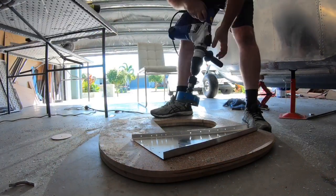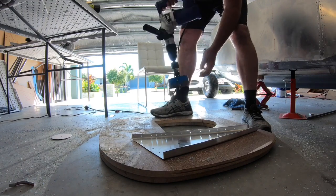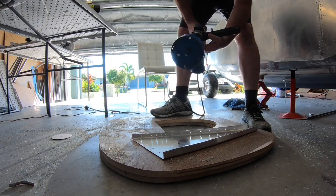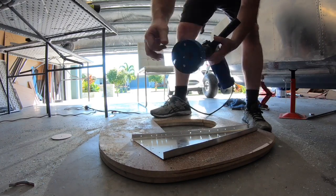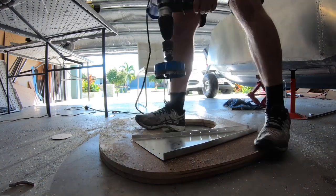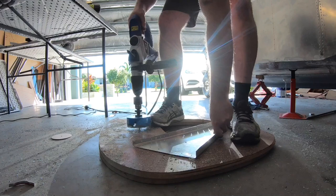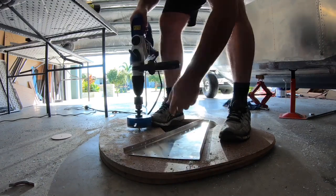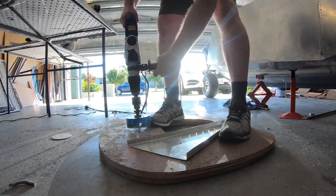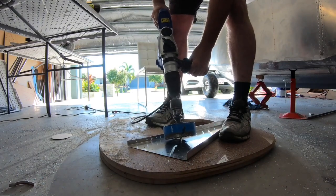All right, here's the drill — a big rotary hammer drill. Runs quite slow, which is really good — it's what you want. This has drilled heaps of holes now. I've pre-drilled where I want it, so I just line up that center pilot hole and drill through. One foot has to go here — it's going to spin this way, so you want that foot there to stop it spinning.